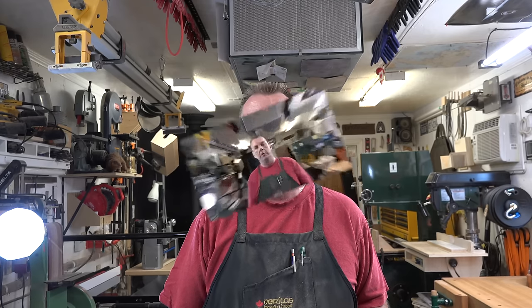Well, there are all kinds of sizes of peppermills: an 8-inch, a 12-inch, I think an 18, a 24-inch. It all depends on, of course, your lathe size and what size you want to make. Today I'm going to be making an 8-inch peppermill, which would be the smallest of the peppermill family, but it's a lot of fun. For an 8-inch peppermill, we're going to need a 10-inch long blank, 2.5 by 2.5. Now I'm going to make mine a little longer, at probably 12 or 13 inches, only because I want to turn a matching salt shaker.